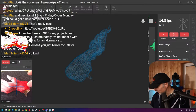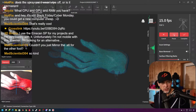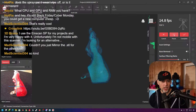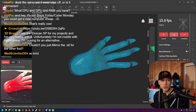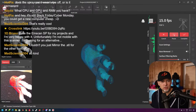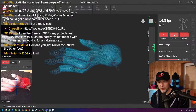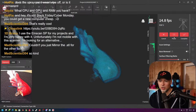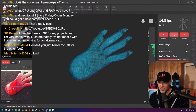And so, yeah, then you understand that if you're scanning a globe which has two symmetrical sides, considering it has a holding piece where it's standing on, where it's held in, it still has two sides that are kind of similar, almost identical, and so it's really struggling. So that's why I was using these scanning markers, and that helped. So that's good to know that you cannot really rely on the actual visual information on the object, but you really have to have physical tracking, or you use the scanner markers, which is a different scanning mode. But then it also doesn't work without the scanning marker. So you can just turn on the scanning marker mode and then wait, but it really needs to have the scanning markers on the object.